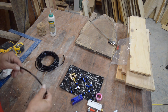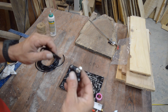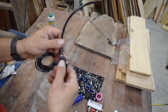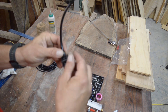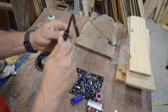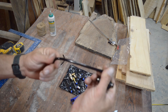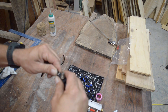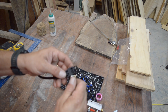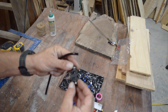It took me a second to realize there was a cutter in the kit — I had already broken out the box cutter. I also have this little valve which I'm going to put on the portable enclosure, because my X-Tool air assist does not have a variable output. It's got two screw holes to mount it. The way it works is: tighten it to lessen airflow, loosen it to release airflow. This will allow me — when engraving with the 20-watt Pro — to turn the air pressure down enough to keep gases away from the lens without causing scorching.